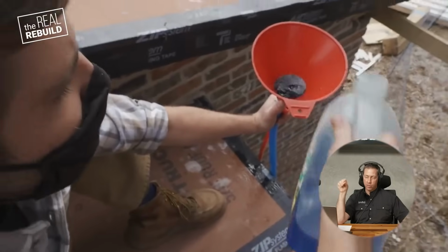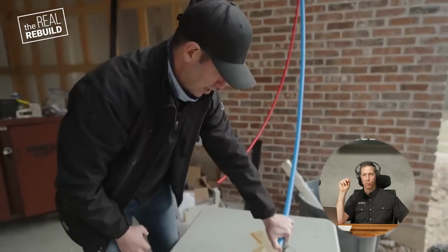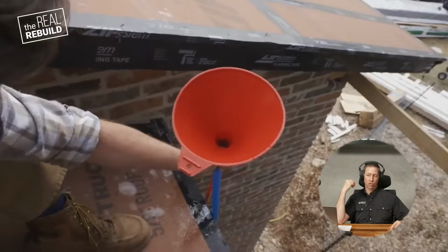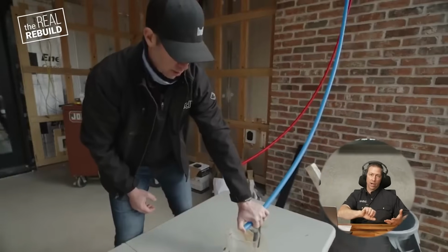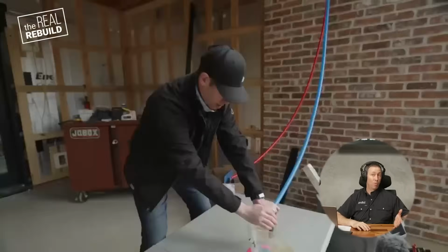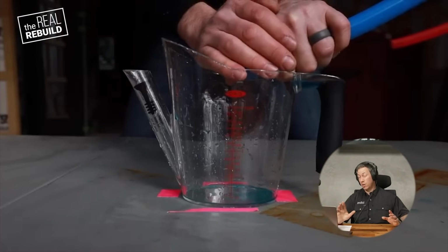But centrally locating your water heater is key, because now my centrally located water heater means that my master is right behind that water location. And so my shower and my 2 vanity sinks, I turn that hot water on in my house and I'm dumping maybe 1 cup of water down the drain before I've got hot there, maybe 1.5 cups.